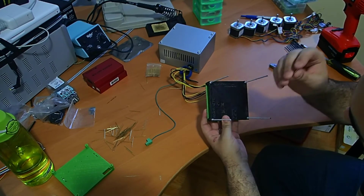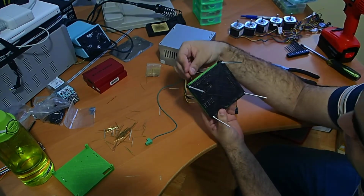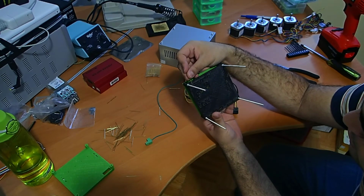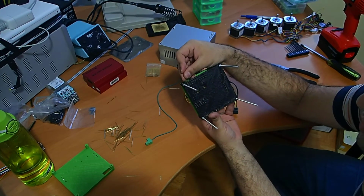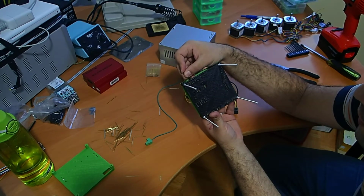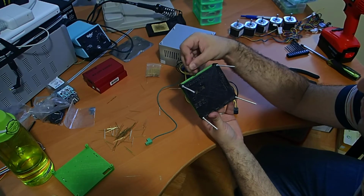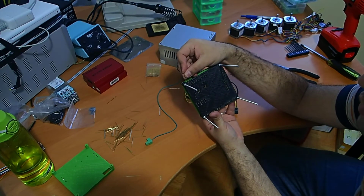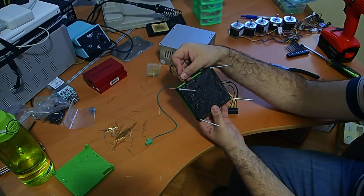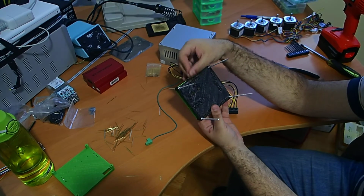One thing to notice is that for the MOSFETs, we only put pogo pins on heat bed, ground and power, and the bed, the heat bed and the heater 0, ground and power, but every other MOSFET only has ground with a pogo pin.